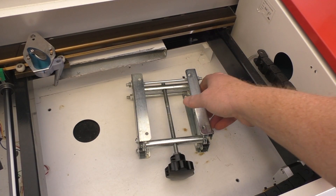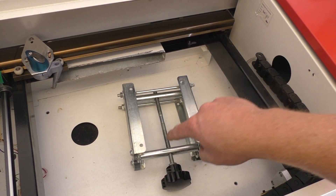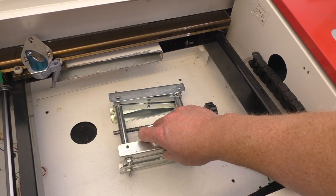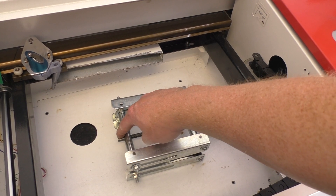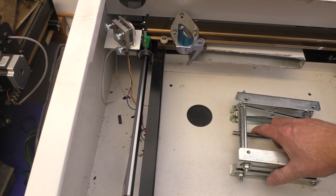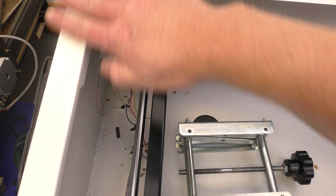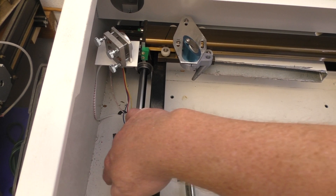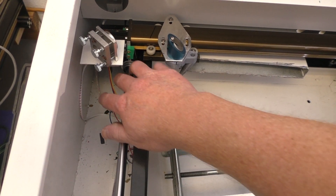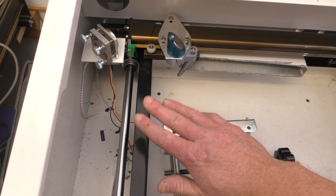I think I've got this figured out. I'm not going to be able to mount this scissor lift this way because of everything it runs into, and the vertical height that the knob travels is going to run into too many things. But if I simply turn it this way, I should be able to extend this to the outside of the laser and have it work there. There is enough free space underneath this bar here because of the downward slope of the laser, so all I have to do is extend this, drill through the outside, and make sure I'm careful of the wires and the mirrors — conceptually it sounds easy.